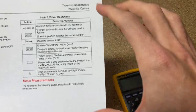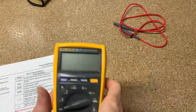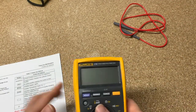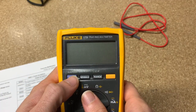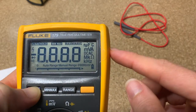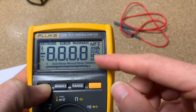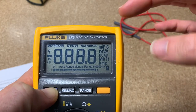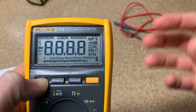Here's a screenshot of the user manual, page number 11. I'll also try to put a link below if you guys want to see it. The first thing we're going to do is auto hold. We're going to hold the auto hold button, turn it on, and keep holding that button. You're going to find this turns on all the LCD functions — all the backlit numbers — to make sure every one of your LCD segments is lighting up correctly.